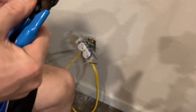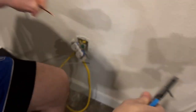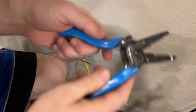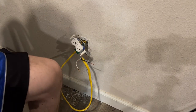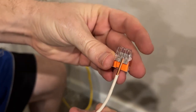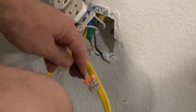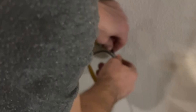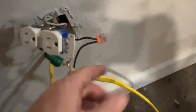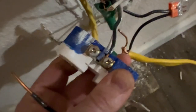We've got our channel lock pliers here and this is 12 gauge. What I love about these channel lock pliers — they tell you the gauge right there. The goal is to not have any exposed wire once everything's connected. What's really great about these push-in connectors is the clear plastic tops tell you if you're all the way in. You just push them in and they stay locked. Let's get this one pushed in as well — that's all the way in. The copper wire is pretty much at the end, and now we'll have the last hole available for the pigtail.